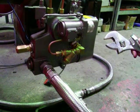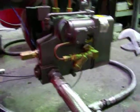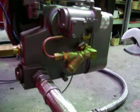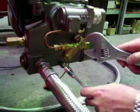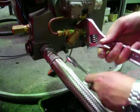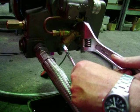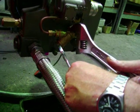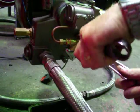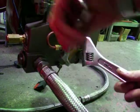Okay, welcome back. What we're doing now is we're going to inspect and remove the stainless steel filter from the Y strainer on this BR10. Okay, so very important that the body of the Y strainer itself doesn't wobble around too much. So you stabilise it by putting this spanner on the body here, and what we're going to do is then lift the left hand side up. We've had customer feedback that these can be hard to remove, I believe you.